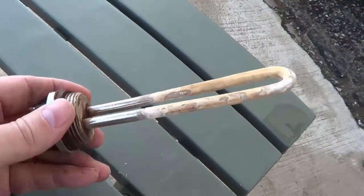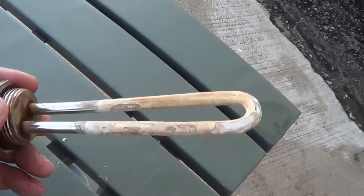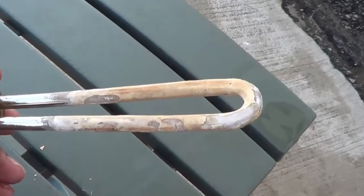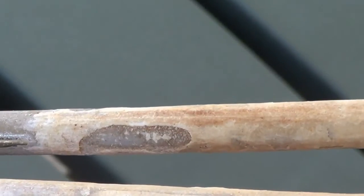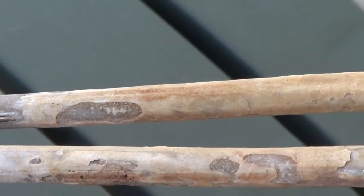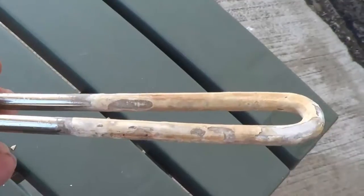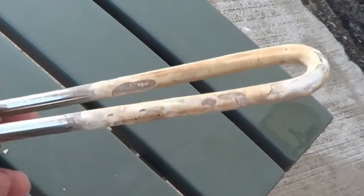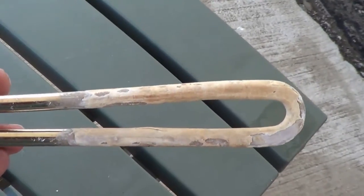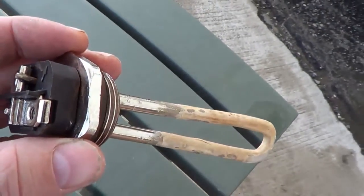It's a new day, so I emptied the hot water heater again and pulled out the element. I can kind of see my mistake — I didn't quite get all of the corrosion that had coated the element off. I'll probably have to chip that off. So rather than mess around with this element anymore, I'm just going to replace it. I always carry a spare just in case it burns out, so I'll put a new element in there and see if we can get rid of that singing noise.